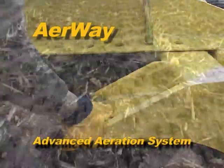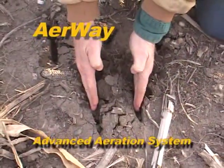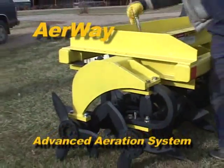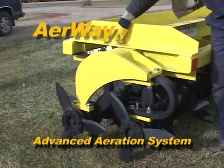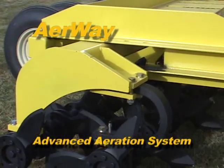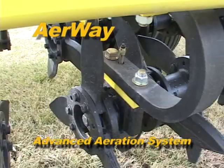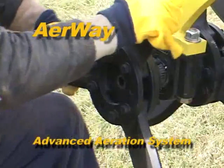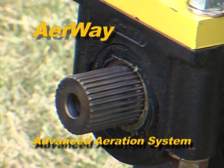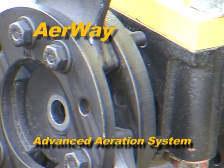With the CCT machine, we're 3.5 inches apart with the tines as it goes through fracturing the soil. By changing the degree of the machine, as everybody has their own idea how they want to do, more tillage or less tillage, that's what makes this machine so unique. Simple to change, just pulling the pin and changing your angle if you want more tillage or bringing it back to have less tillage. By removing the outside star, you have easy access to inspect bearings. A greasable, heavy-duty sealed bearing and pillow block are used for long life and less maintenance.